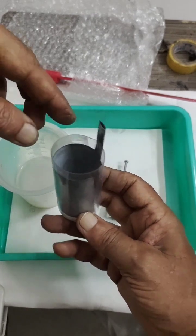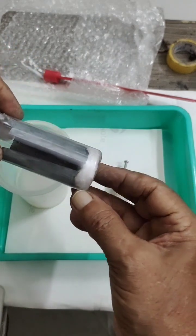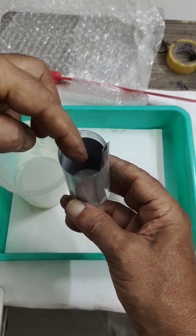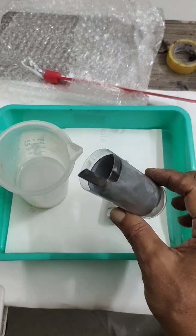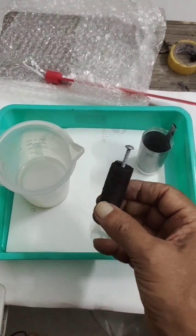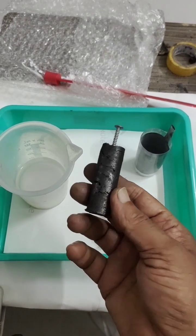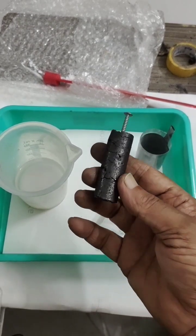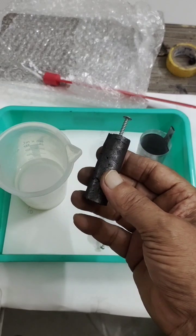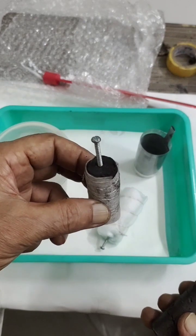The zinc-coated aluminium plate I have slowly inserted as a circular shape. You can see at the bottom there is a ceramic pad just to avoid discharge between positive and negative. Now the positive carbon rod — I mixed manganese dioxide with carbon graphite, made a paste, and fired it. It became a graphite rod with MnO2 and a trace of cobalt and lead.